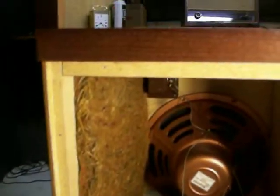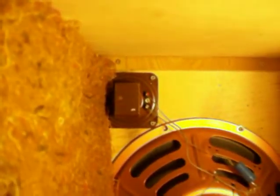inside. Pretty well done. But you look at the size of that driver. It's a 12-inch driver. There's a 3 or 4-inch paper tweeter, a couple of caps, and there's like a 6-inch mid-range driver. The mid-range driver is fired out the bottom of the cabinet. You can actually put your hand up and touch the front of the driver. They're labeled Jensen Golden Concert Series, and they're made in Canada by Renfrew Electric in Renfrew, Ontario.